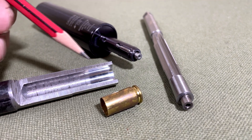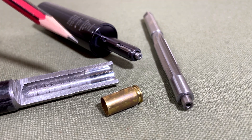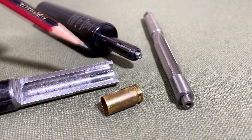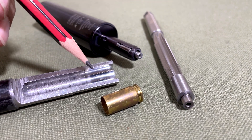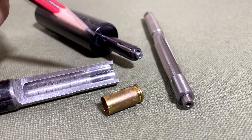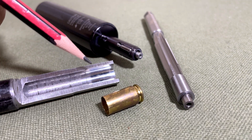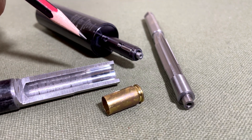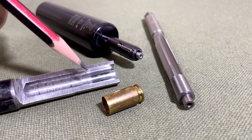This is how, when you look at a lot of factory rifles produced by the big companies, their chambers are like that — they do use these burnishing tools quite a lot. Having a tool like this allows you to have a chamber that is smooth, and will allow the cartridge to feed and extract more easily with less wear on your cartridge case. The surface of the metal can flow more easily on a perfectly smooth surface. That's the end result from using the burnishing tool.